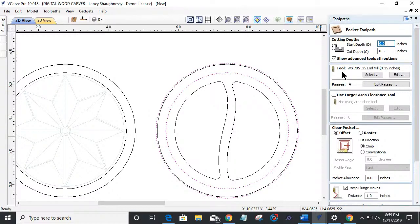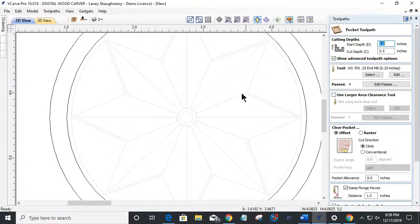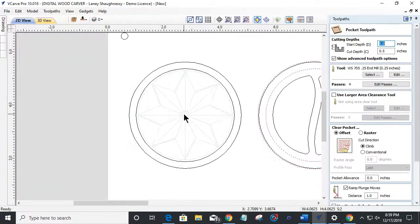Now, I am going to do some carving in here, okay? And on the other side, right? I'm carving in the lid. Now, if I pocket this out 3/8 of an inch deep, right, then that means I have 3/8 of an inch to work with on the other side. For me, that's fine, you know, but I don't want, when I carve down 1/8 of an inch on this other side or something, I don't want it too thin, right?